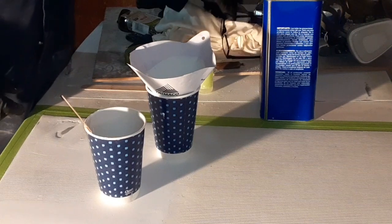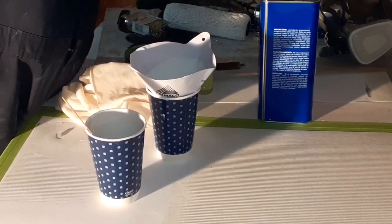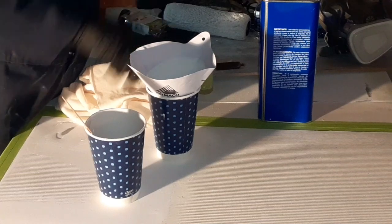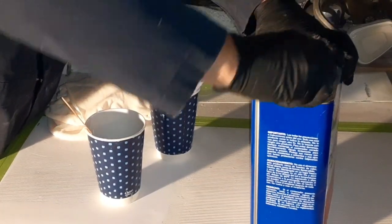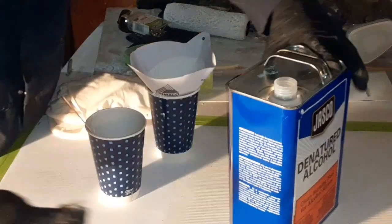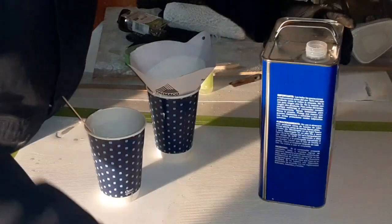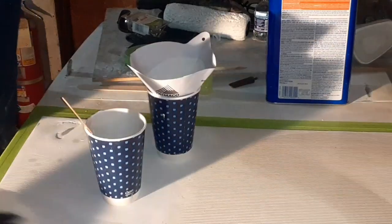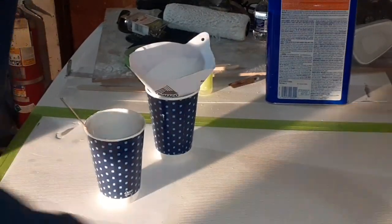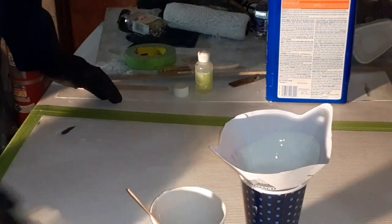It's time for PPE. What I will do before I put any gel coat down is use the denatured alcohol to clean the entire surface, because some of this gel coat had a little cracking with age. Having everything set up before you start a job like this will actually be beneficial — having everything right there at hand. I've got all of this stuff on a thin piece of ply on the opposite side that I'm going to be working on. Then I will prep the surface area and wipe everything down.